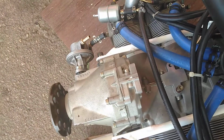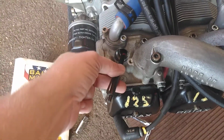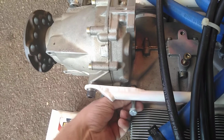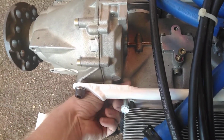And the point is that you're trying to get cylinder 1 to top dead center, and you can do that with a feeler gauge, my super accurate feeler gauge here of a plastic ballpoint pen, and then you can rock it with a 15/16 impact socket or a big socket with a breaker bar, and find where top dead center is on that.